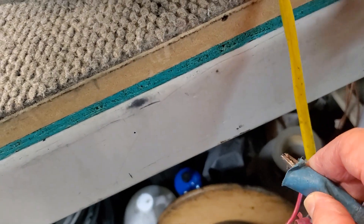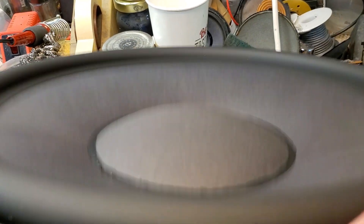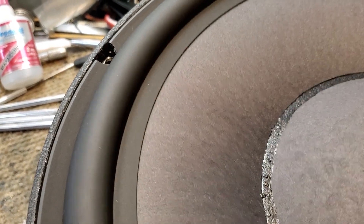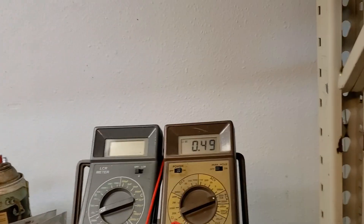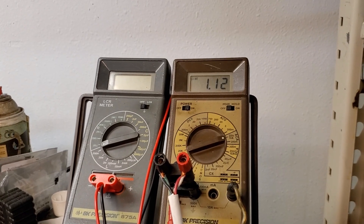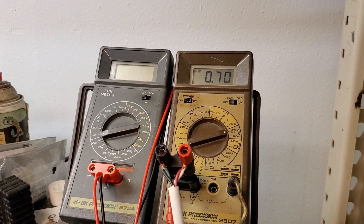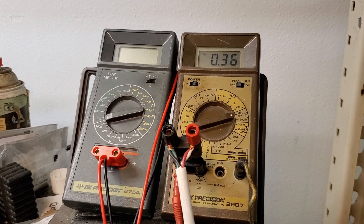You say, 'Don't tell me, show me' — so there it is. That's at about 20 hertz. That clicking is my sweep generator being a little dirty. But if we click over to current draw and go to the target tuning, it'll be at minimum current draw. You can see as I go up — that's about 40 hertz right there — current draw goes up. We look around for the minimum current draw, which is the impedance peak.